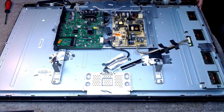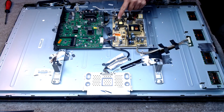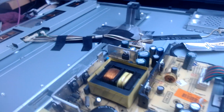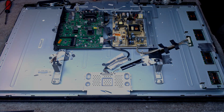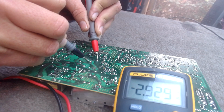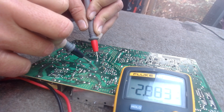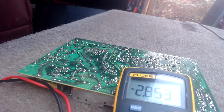But we've possibly got to this in time, so let's see if I've got those capacitors. That's, from memory, a 27 volt, and there's a 450 and 1000. I'm guessing that's gone, but we'll see. Obviously, being the safety conscious professional that I am, I'm just going to make sure that this is not going to kill me, and there's just 2.9 volts in the main reservoir cap, which is dropping slowly, so it's quite safe to work on.